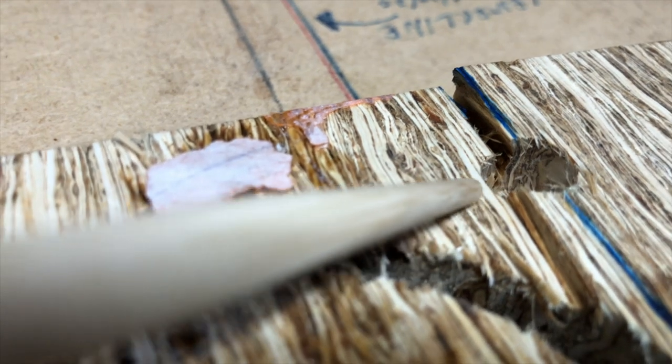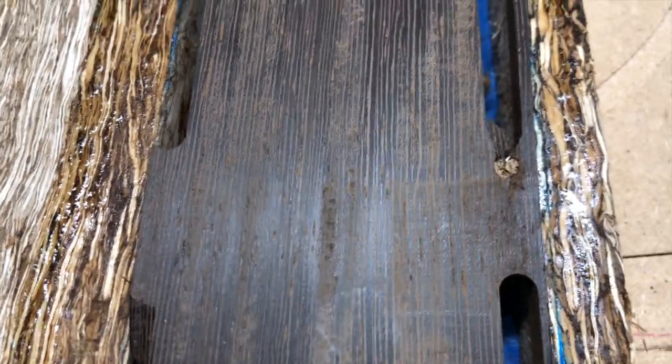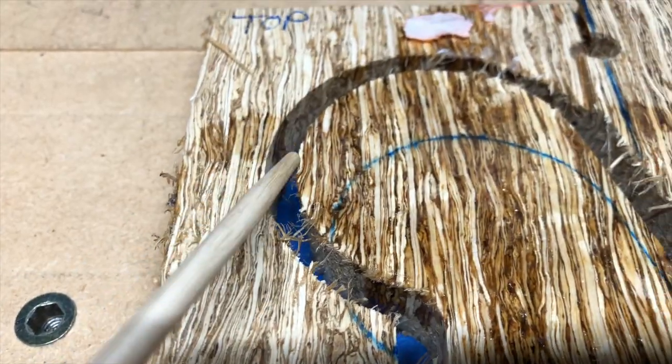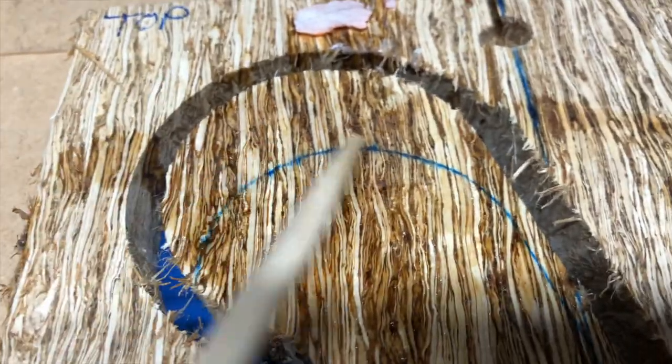As you can see it's not even level. The whole point is just to get the locator pin in position. The locator pin and frame is not holding the workpiece down — the neck itself is held down by super glue and tape on the flat side of the headstock and heel. The pins are just there to locate it correctly for the two-sided milling. Since it's splitting along the grain very easily, when this is milled down to about 15mm, these pieces are going to be really brittle. So I just flooded the whole surface with very thin super glue.